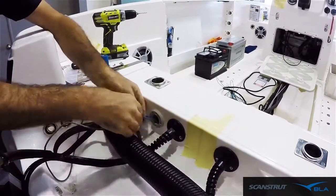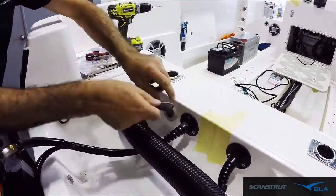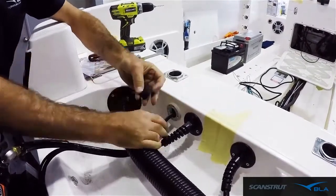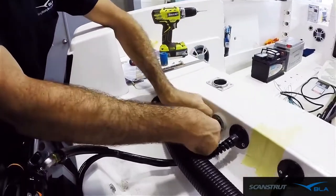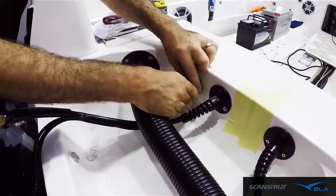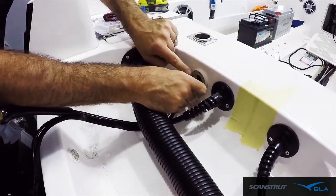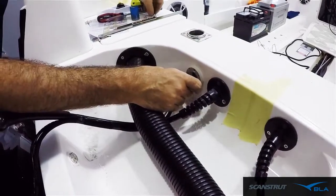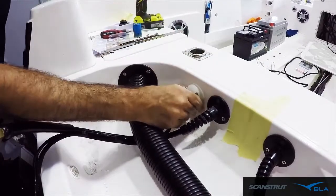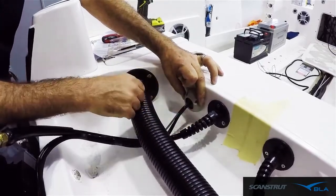This one's a tight squeeze, but it makes it. Get that through. Then it's a matter of just opening this out, putting that into place, and then putting the finishing cover on. And there we've got key threaded nuts there, so that's all captive in there to take those. So we just get that up, button them up with a screwdriver, and that just pulls it all in and squeezes the grommet around the wires and becomes a watertight seal.